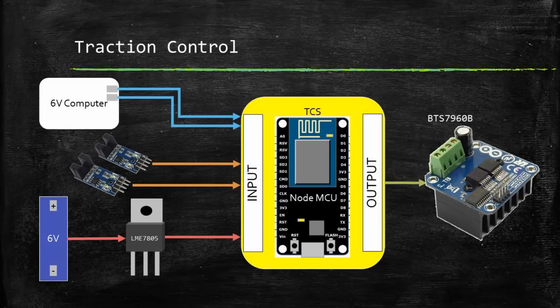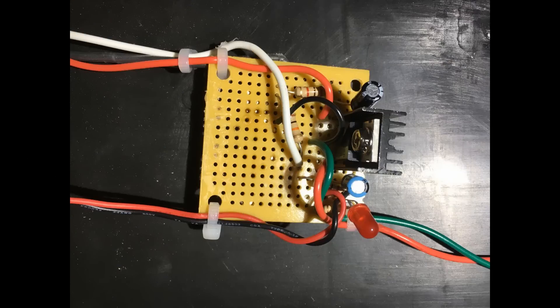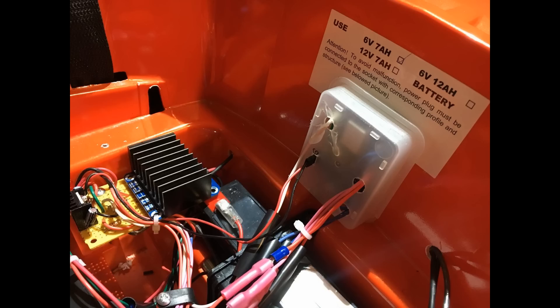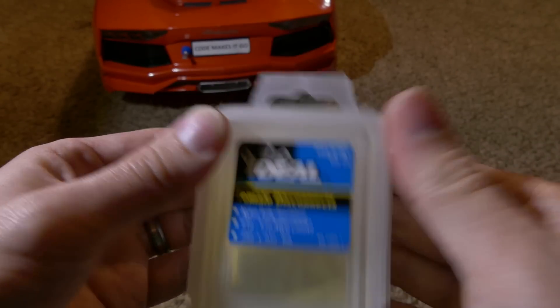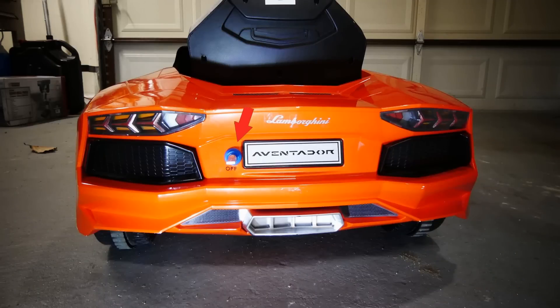Replacing the MOSFET with the H-Bridge was a great decision. It simplified the circuit a lot. I removed everything from my power board except for one important component, then attached the H-Bridge and everything was finally done. I even put the NodeMCU in a nice little project box — nothing more than a plastic container for spade connectors. I also added an emergency off switch so if things went wrong, all I'd have to do is hit that and the power would shut off.